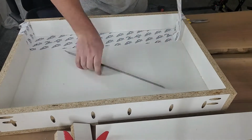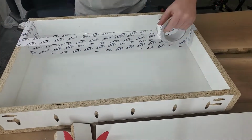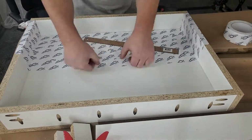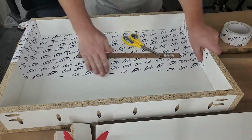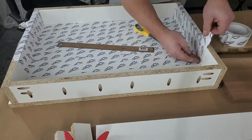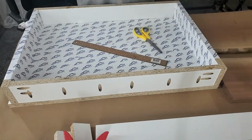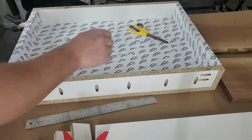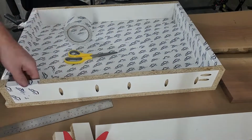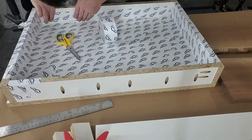Now to prepare this mold, I put some silicone caulking in all of the corners the whole way around, and then I wiped it in there pretty tight to the corners, and then I covered every surface that's going to be touched with Tyvek tape. The idea here is to create a complete surface where the epoxy won't bond at all, because if the epoxy bonds, it makes this a nightmare to get apart. Then you also want to make sure that your epoxy doesn't leak outside of the mold, because it will. It'll find the smallest hole and leak completely out onto your table, onto your floor, and just ruin everything anywhere near this project.